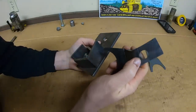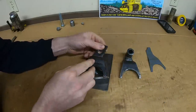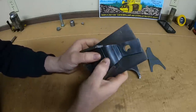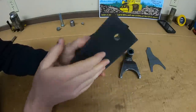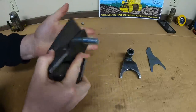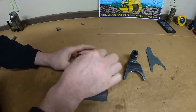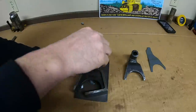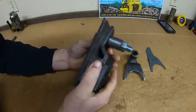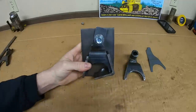Continuing on — I drilled the five-eighths hole in the top off camera; you've all seen me drill plenty of holes and it was pretty simple. I just clamped the fork into the fixture and used it as a guide. Now I throw the bolt in the top, we've got the collar which is this piece right here, and run this nut down — clamps everything securely in place so we can throw a weld bead around there and nothing's going to move around.